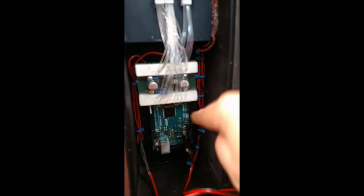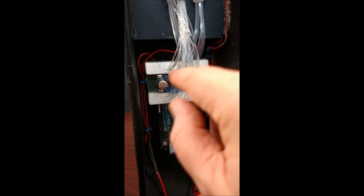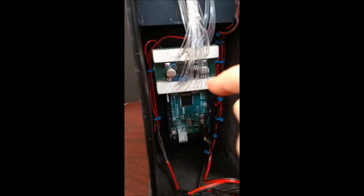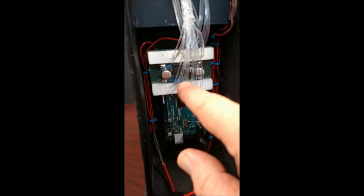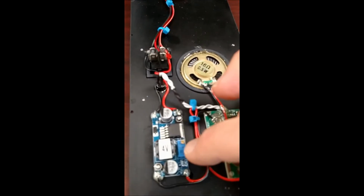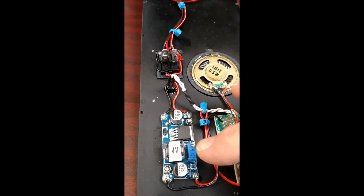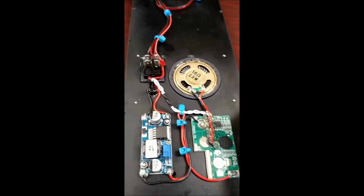That's the Arduino board. This is the custom board with the custom manifolds that I also put onto it. There's a regulator board on it. There's a screw on there. You never want to adjust that. There are also screws on the other regulator boards. You never want to adjust those. If you adjust this screw on any of these boards, you can increase the voltage too much and things will blow out, and that is not covered by warranty. So let's go back into here.